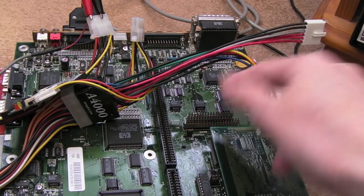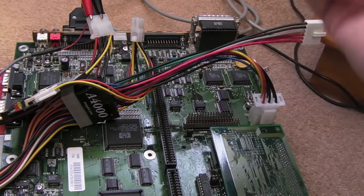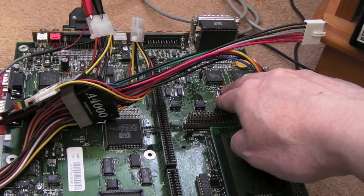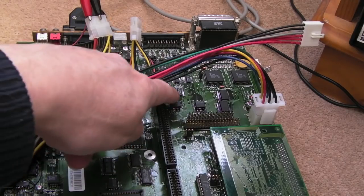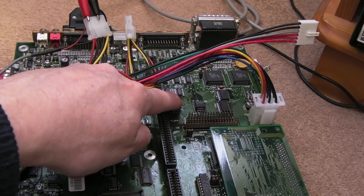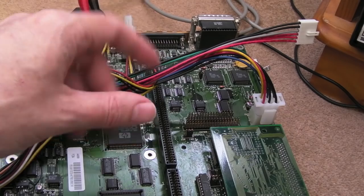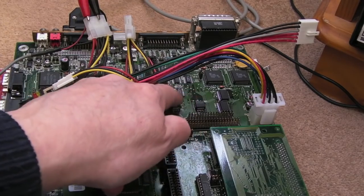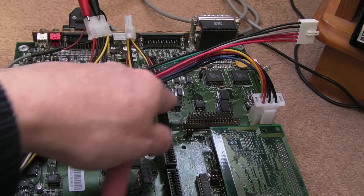I thought, hang on a minute, those are from the other board. We don't know the state of the other board. And we still don't know the state of these from the other board. Well, we do now. So maybe those are faulty, so I put the new ones on, still the same. And at that point, I did what I should have done right from the start, which is to look at the inputs to these chips here, in particular these and that, and work out that address decoding is obviously super critical. If you've got one signal missing going into one of these from elsewhere in the system, this is not going to work. This whole circuit's going to do nothing.